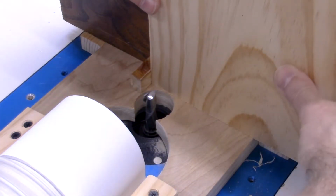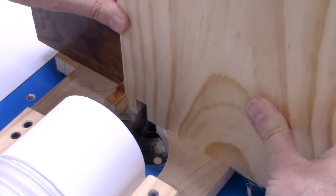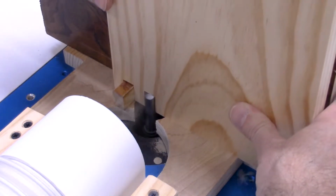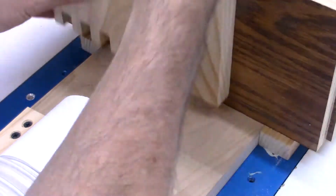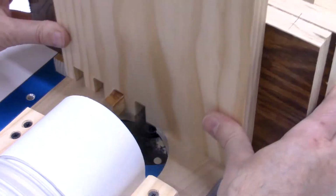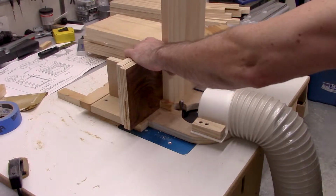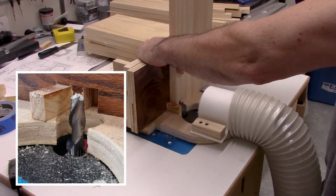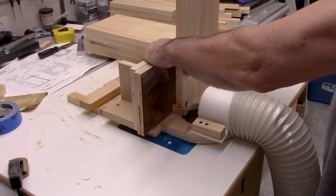All of your box joints or finger joints, depending on the width of the joint, get cut. And I've got my router hooked up to a foot switch, so I step on the foot switch and the router will spin up. That way I can keep my hands on the piece I'm working on, keep things basically held in place so I'm not reaching for a switch. And if anything would go wrong, all I have to do is step off it and the router will come to a stop. I'm using an upcut spiral bit, ½ inch cut. Since my router is upside down, it's actually a downcut bit in this use.